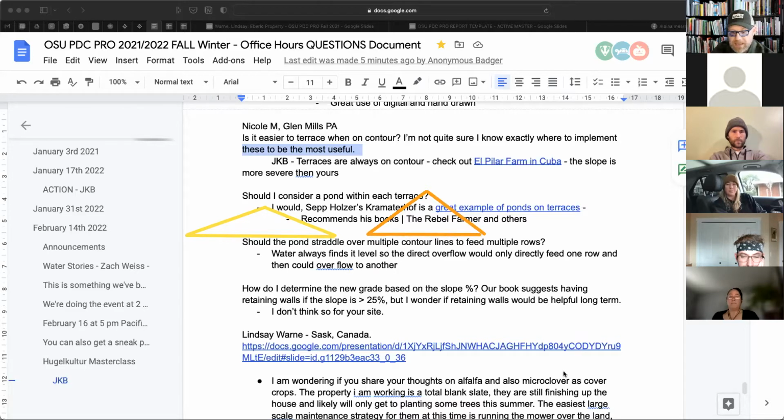And then clay, especially if you're getting to 40%, if anybody's worked with clay, can have an almost vertical angle of repose. So depending on the type of soil you have, you'll find that angle of repose, and then that will determine what your sloping is. It's too much just to say, if you make a terrace, doesn't matter where, that it only has to be 25% or whatever. You have to be in the field and you have to work with it and actually see it. So it's basically cut and fill.